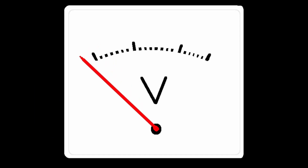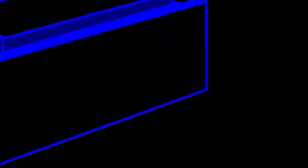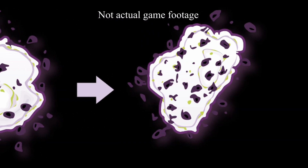If your battery is old or has been run down too low too many times, there is a good chance it might need replacing. Even if your battery is reading fully charged and can power your lights and USB chargers, there could be damaged cells inside the battery, and as soon as you put a heavy load on it it will fail and your heater will not start.